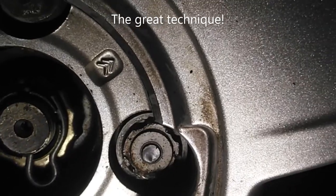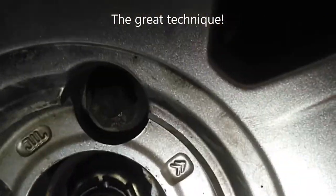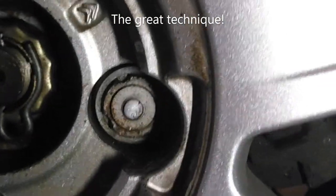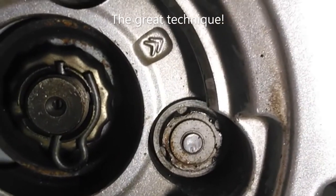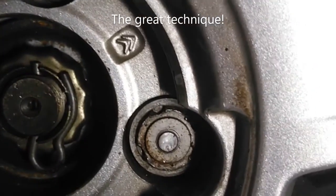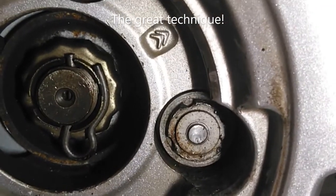It's hardened steel, so I'm going to have to use cobalt drill bits, and I'll try and drill it out to size, to about 9mm. Find something with a spline on it, knock it in as hard as I can, and hopefully that should do it. I'll let you know how I get on, I'll do it in stages, and we'll see.